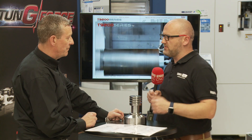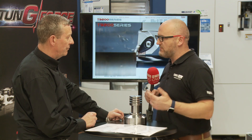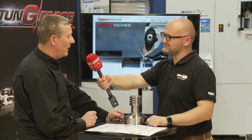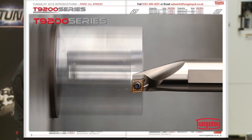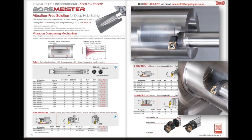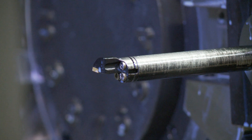How about the materials and whether it's an intermittent cut — going through some grooves possibly or a casting? Does that have any influence? I can honestly say none at all. I was recently out in Japan as part of the demonstrations. What they'd taken was a component and sawn a section out of it, so it had become an interrupted bore. The difference between full contact turning and the interrupted bore — we found it very hard to measure any difference at all.